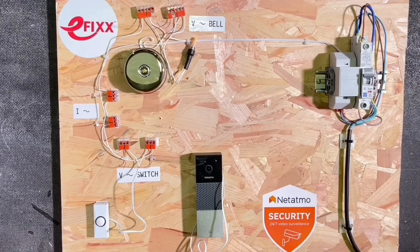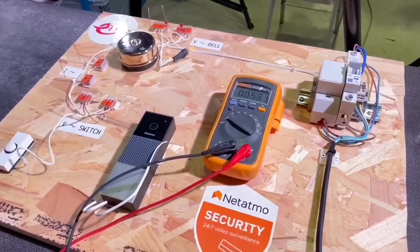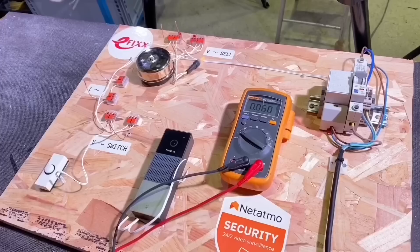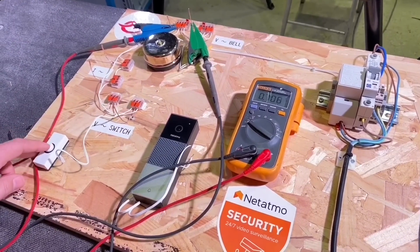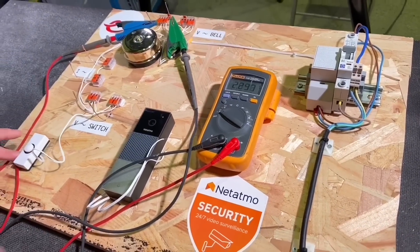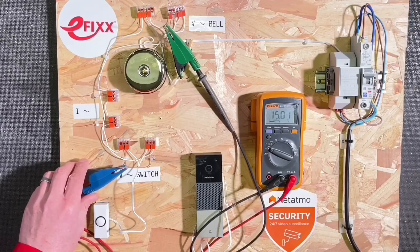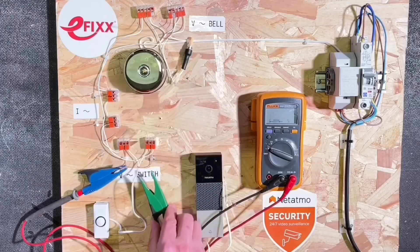Okay, so that's what we've conventionally got in our property. Now you're going to measure some voltages for me? Yeah, let's just see what the operating voltages are in the system — let's have a look at the bell side first. What you'll find is these bell transformers are really quite poorly regulated, so unless you're loaded to the absolute maximum load you'll see a higher voltage than what you'd expect on the transformer. So we've got about 12 to 13 volts there. Okay, and now you're going to measure the voltage across the switch? Yeah — there's 15 volts; that's the unloaded voltage from the transformer.